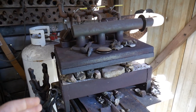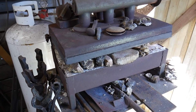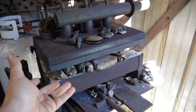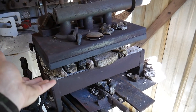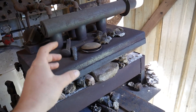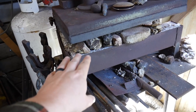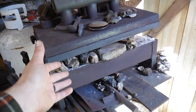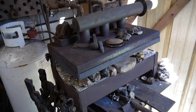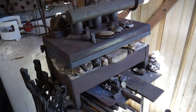One of the last considerations: you do not need a super huge forge for every job. For instance, if I had to run this large forge to make little horseshoe nail hooks, the cost would be exorbitant — the profit margin just wouldn't be there. In that case, it's a lot easier to use a smaller inside chamber, like a one-, two-, or three-brick gas forge for making smallish items. There is a minimum size requirement — once your forge gets too big, the cost is just not worth it. If you're turning out S-hooks in a three-burner gas forge, that's going to cost you more than using a little one-burner four-brick forge.